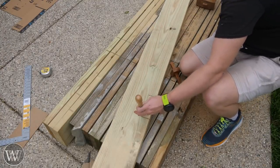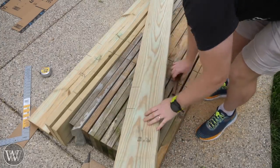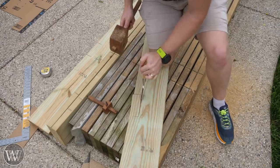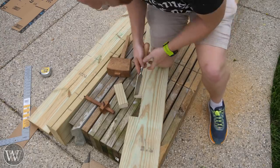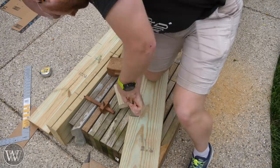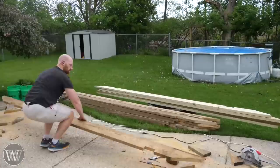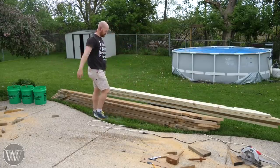Now we need to cut out the rest of that notch. We used the circular saw to chop out either side, and then I can bring out the chisel and chop in from either side to pop out this block. I wanted to get a nice clean joint on here so that they all fit in well. It was important to gang-cut these all together so that all of the slots are relationally the exact same. It was about 15 minutes per board to make all the cuts and clean them out — 17 of them done, so it took a little while.